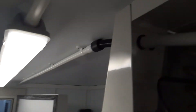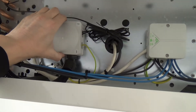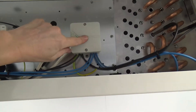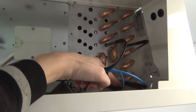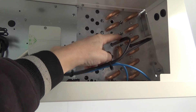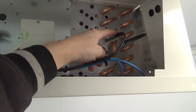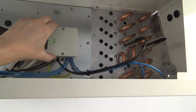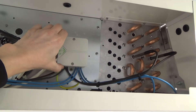The con drip runs along the lights. I've got the solenoid valve terminated in there and then I'm going to jump a wire across to the heaters. What we've done with those is I'm not using the bottom heaters, but I've got the top ones wired in series so they're only about 300 watts. So what we can use them for is if the room gets too cold in the winter, we can bring these heaters on with the fan just to raise the temperature up.